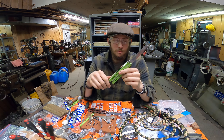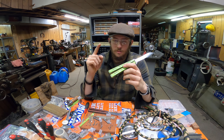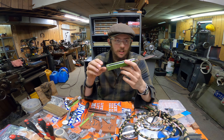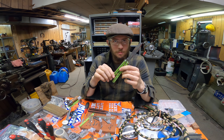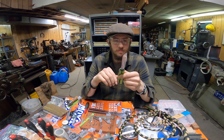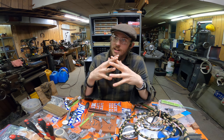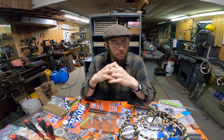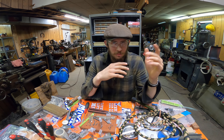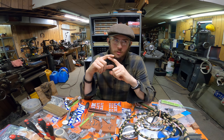This wasn't just a regrind — it was a metric to Imperial hardware swap, which took quite a while. James was super patient. This knife needed new liners, different bushings, some surface grinding, custom spacers, and a little bit of modding to the scales so they cooperate with Imperial hardware. That was a pretty fun little project.